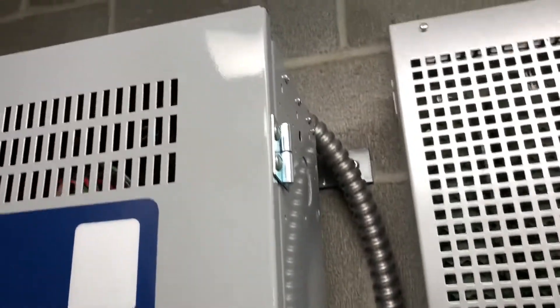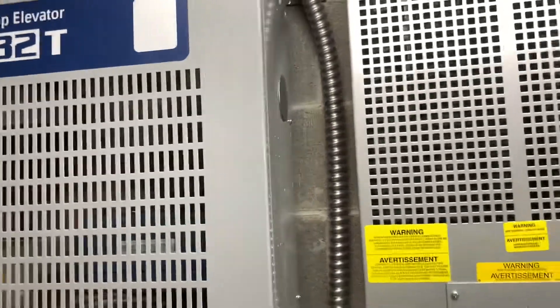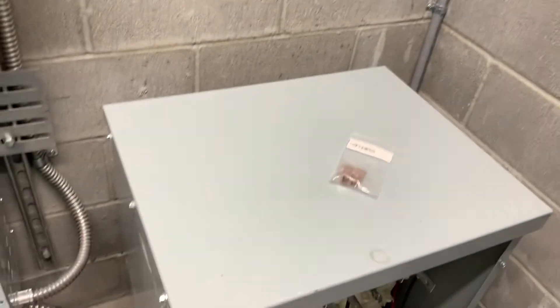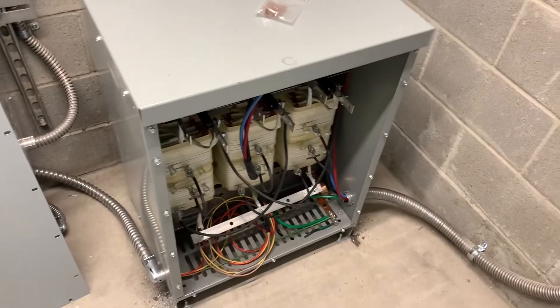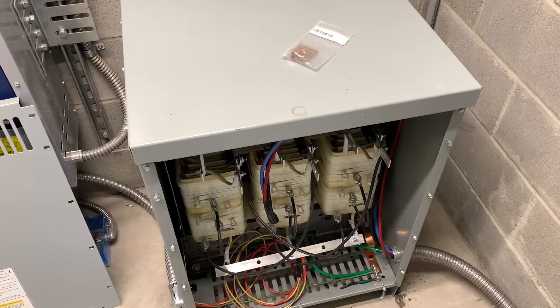Took the one-inch flex all the way around the back — didn't strap that down yet because we don't have the straps. Then took that up to the top with a flex 90, and the wire is sitting right inside of there which goes to the breaker. The wire is running for the elevator guys and they're going to land that. That pretty much took up a lot of the day. Then went up to the sixth floor and was starting to make up apartment panels.